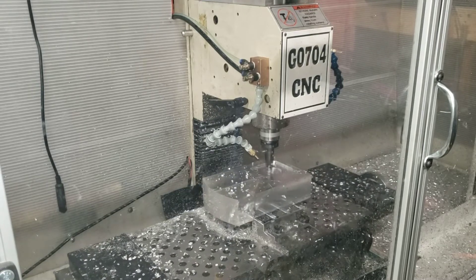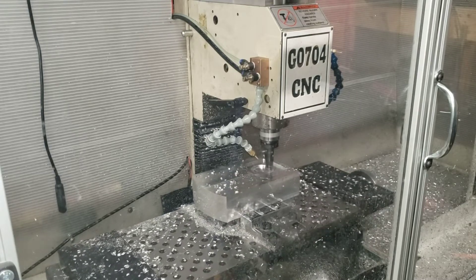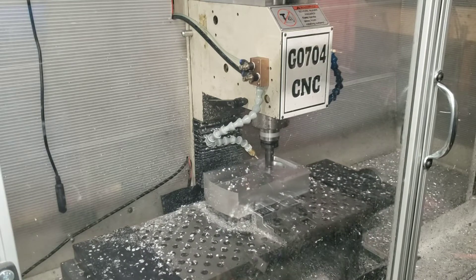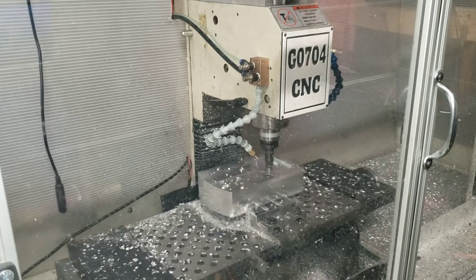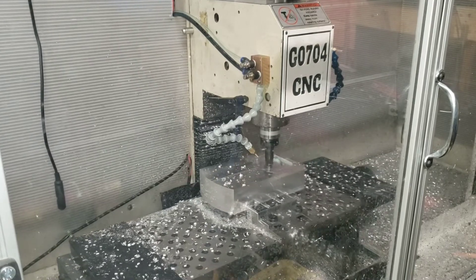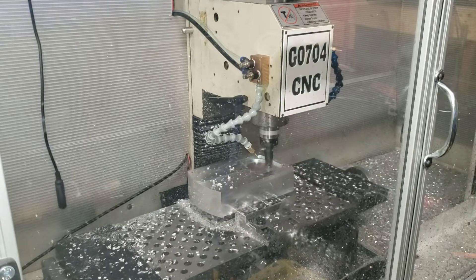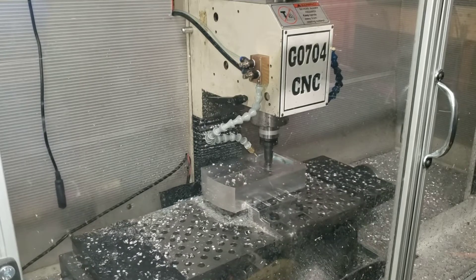The video skips around — I missed the drilling operation. I was using just a cheap drill bit for one of the holes and it was horrible; I had to slow things way down. I did have some better drill bits with proper relief for clearing out the chips and those worked out really well. I missed videoing all that because I was frustrated at the time, but we'll get some videos of drilling showing that when you use a good quality drill bit and a proper peck cycle, there are no issues with low speed drilling on this motor. I haven't tried anything larger than a quarter-inch drill bit — a quarter-inch was more than fine.